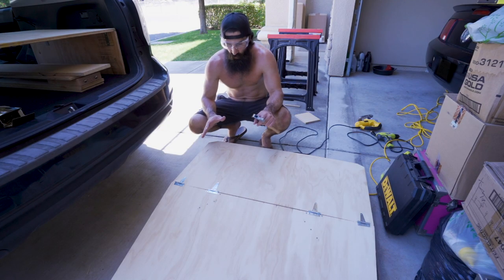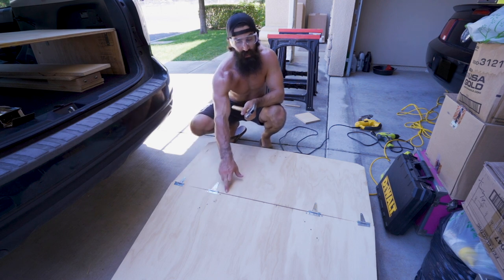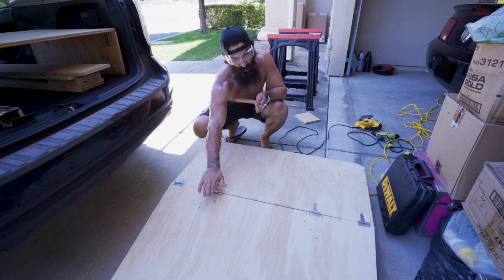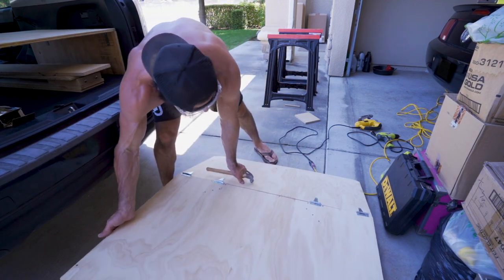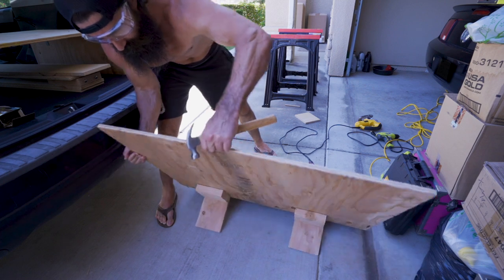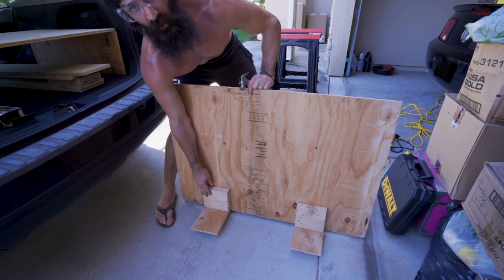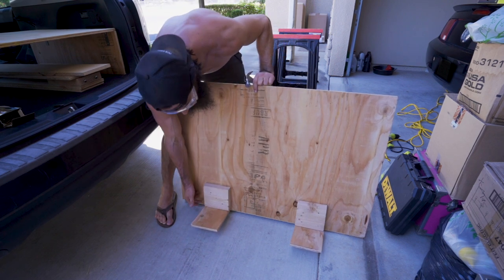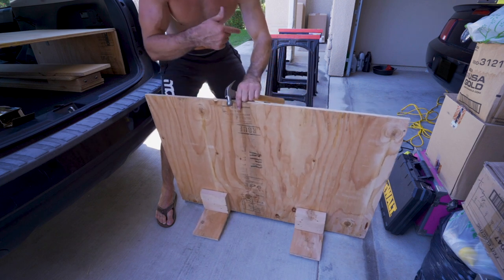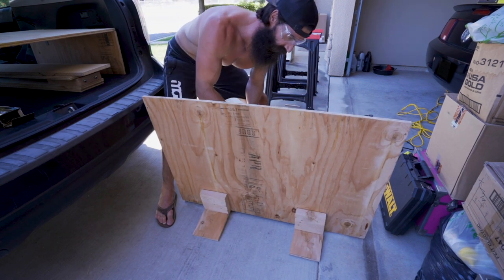What I'm doing now is going along with nails and putting reinforcements along the hinges, and I also did that with the extra support underneath. I added three nails each and then one screw on the end. Now I'm going to flip this back over and continue with the hinges.